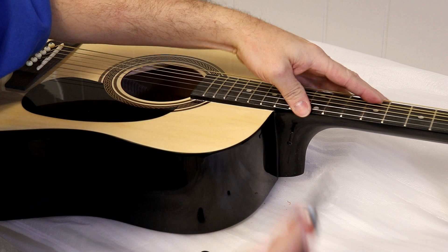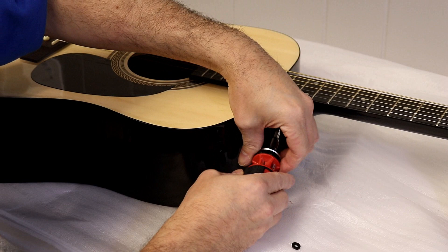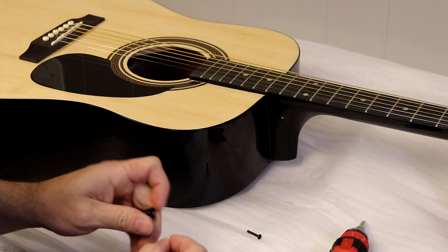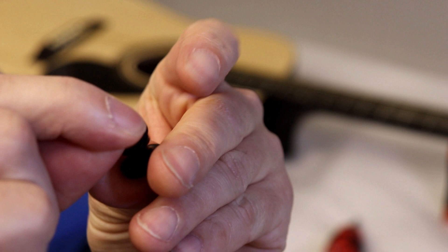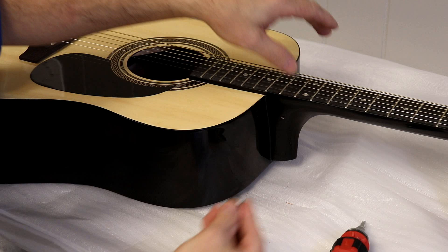So it's ready — then I'm going to back it out. I've already kind of pre-threaded here. It's a really small hole in there. Going slow because you don't want to split the finish on the outside. I actually have a ratcheting screwdriver here but any old screwdriver should work. Now let's go ahead and add the washer to the back — there are no instructions but this is the only thing that makes any sense. And then we're going to run the screw right through there, which keeps you from having to use a self-tapping bit on the outside.